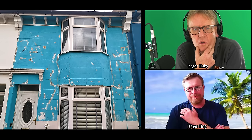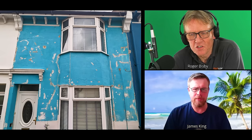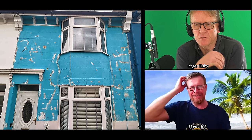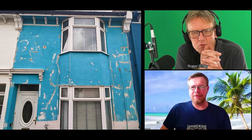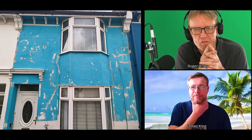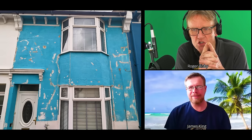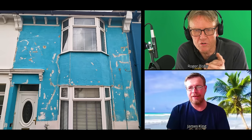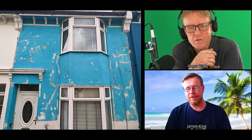There's a problem with the PVC windows — they don't look like they've got trickle vents. We do see quite a lot of trouble with condensation, but this is not condensation — this is in a different league. That air brick is literally going from the outside straight through to the inside, doing nothing except freezing the room. What I think has happened is somebody spouted the mantra: 'the house has got to breathe, you've got to get ventilation,' and they put air bricks in everywhere. All it does is chill the place down, causing more condensation around the bay because there's no heat there.